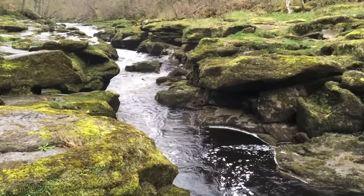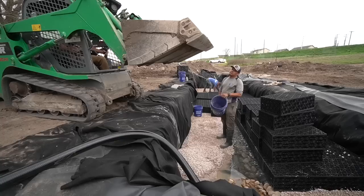The whole thing is a colony of microorganisms — we're creating the structure and space for them to colonize. We don't want to gum it up with sand and mud, so we want dissolved organic compounds but nothing visible, because if it clogs, they suffocate. The water comes in and spreads out through all of these blocks with all these little openings. The water is constantly being mixed, mimicking a natural river system. The team behind us is starting to install three-to-five-inch gravel — approximately 12 inches of that layer.